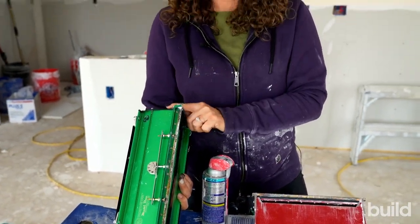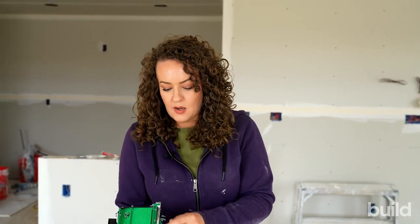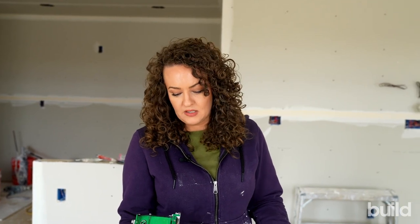You do not want to have to come back and be trailing your boxes with skimming blades. If you are overfilling or your blades aren't set right, don't be trailing them. It's pretty much negating everything that you're using the box for. So make sure you're taking the time to check your blades, get your settings correct, and then you're not overfilling your joints and having to take all that extra time running behind it with a skimming blade.